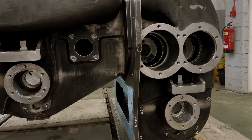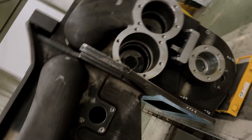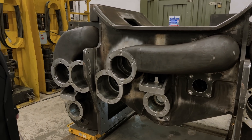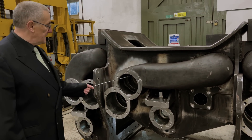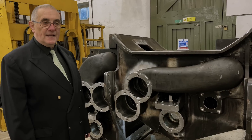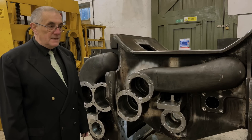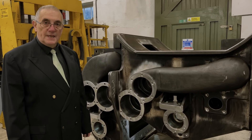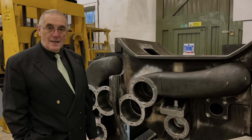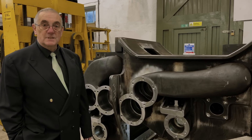Again, we have a cast steel steam port feeding at each end. These cast steel steam ports represent a major departure from the original design, which was flawed by having the ports feeding these cylinders built in to the centre casting, where in some cases they were separated from exhaust only by a single thickness of cast iron. This had the downside that when the engine was working hard, the incoming steam was superheating the outgoing exhaust — up to 100 degrees Fahrenheit when they measured this on the V3 plant. This is, of course, very undesirable because that's wasted energy.